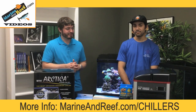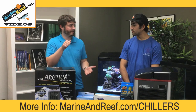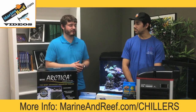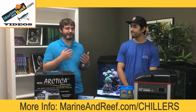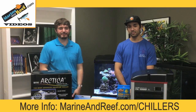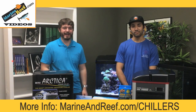There's not much maintenance cost with chillers. Generally you just need to clean the screen that builds up dust so they can breathe properly, and clean the insides with vinegar every three to five years. Other than that, there's not much extra cost and you won't be replacing a lot of parts — it's something you buy for the long haul. If you have any other questions about chillers, feel free to reach out to support at marineandreef.com and we'd be happy to help you out.